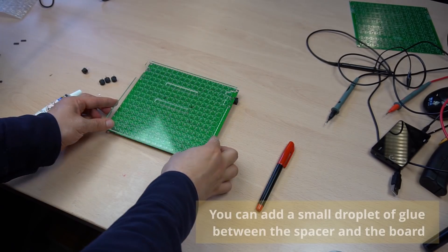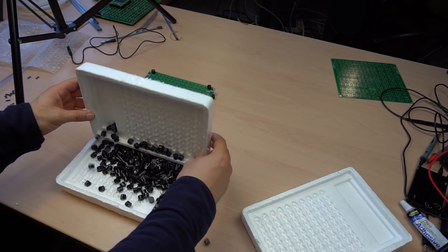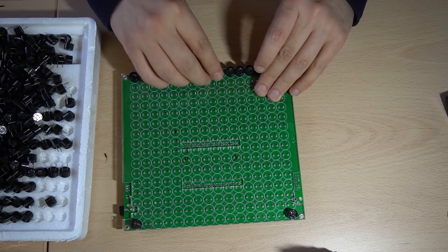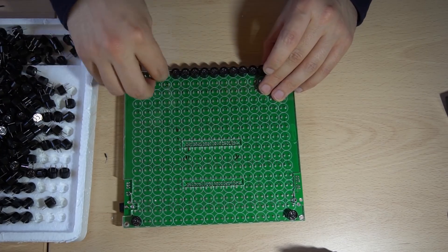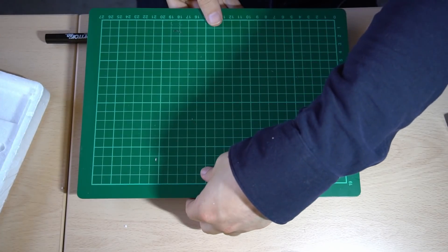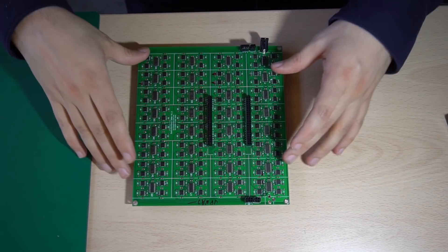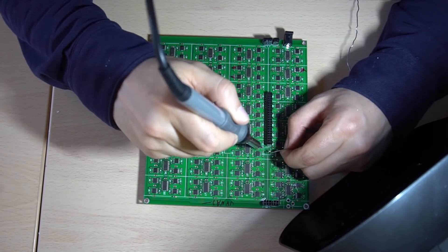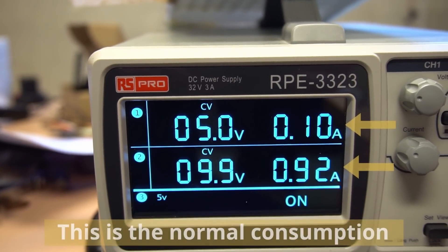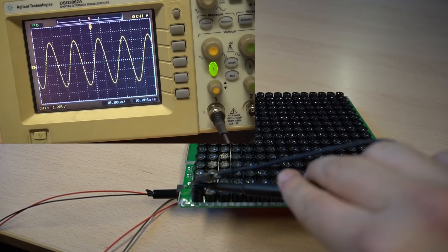Put a laser-cut spacer so that the transducers sit flat, though this is not completely necessary. Put all the transducers — you can mark the polarity now or calibrate later. It is okay if a few channels are broken. Carefully flip the board using a rigid plank, like an omelette. Now you can solder the transducers. Check for shortcuts, then put 5V into the 5V rails and 9V into the 18V rail. Check with a spare transducer connected to the scope that all the transducers are emitting.